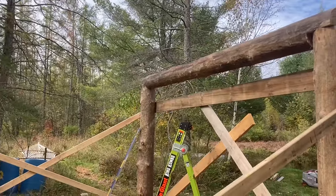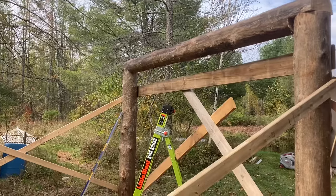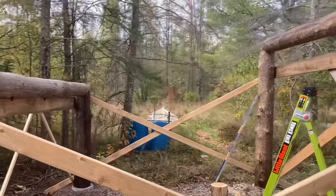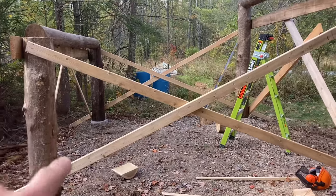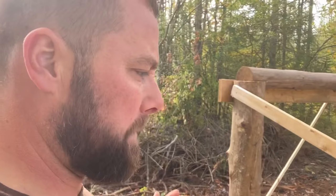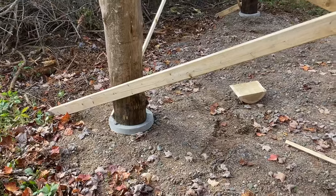So I'm gonna find four rafters, start with four, I might need five going down, and then I'm gonna put these in with timber screws, probably just one each is good enough. And then I'm probably gonna put cross pieces in from here to here, probably two or three on the sides, and two in the back to help hold the wood and keep this whole thing like one unit, so it moves at once, you know, nothing's gonna slip off these little pavers. Otherwise, the hard part's done. The rafters are easy. I just gotta find them. Hopefully I have some over in my wood pile.